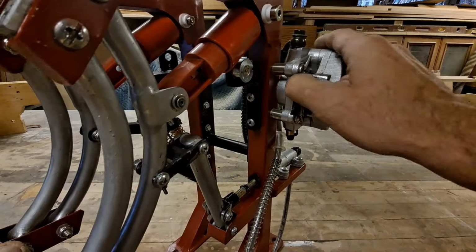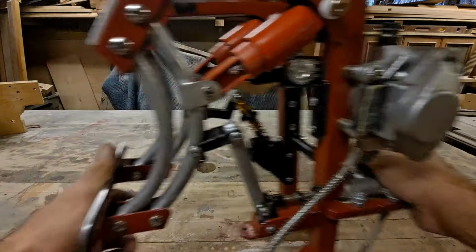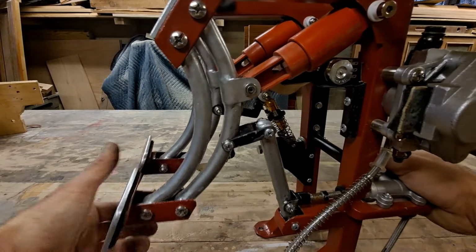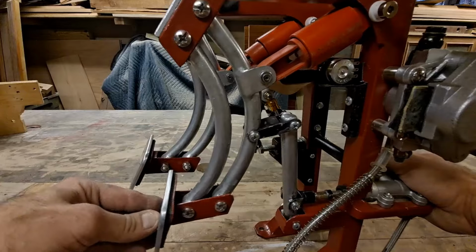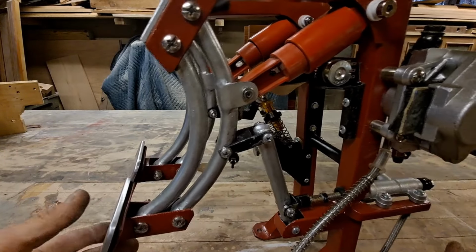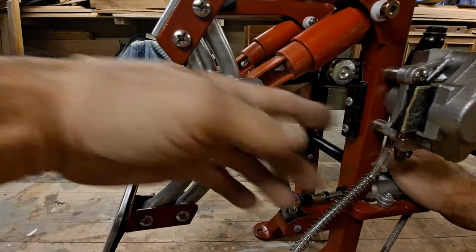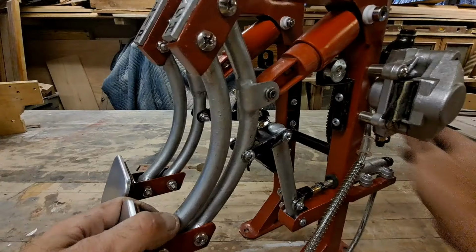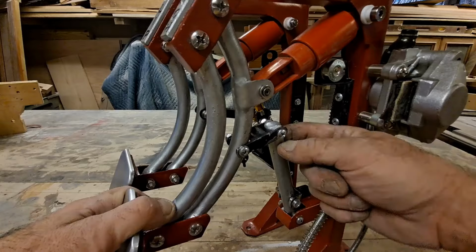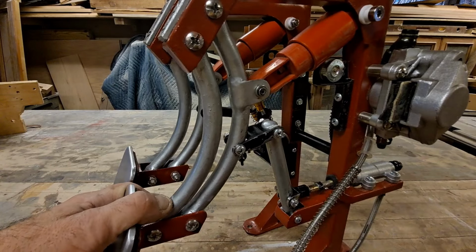Right now I'm using two pieces of steel and a piece of rubber, not dissimilar to what I had before. And you can see it's pretty good friction. I got maybe about 1.5 inches of travel before it really starts getting tight. Once these are mounted and I can actually lean on them, I'm sure I could push this down a little further. I could change all kinds of stuff on here. And if I really wanted to, I can always change this location. I could drill more holes down here, and I can actually swing this down and change that also.